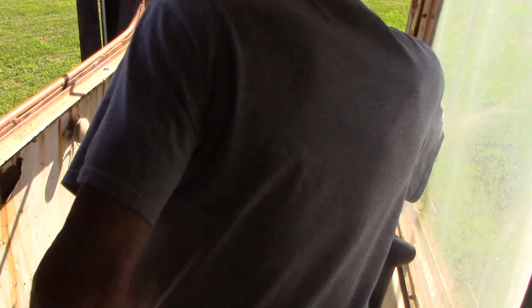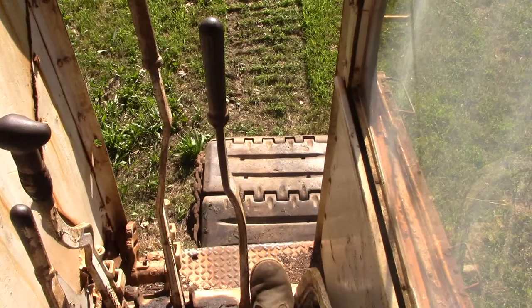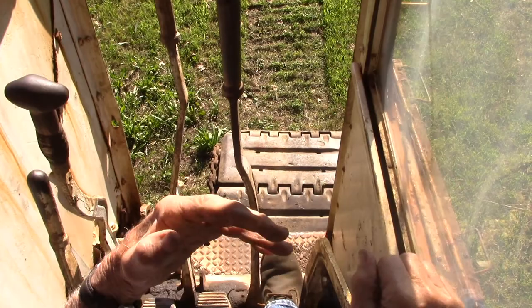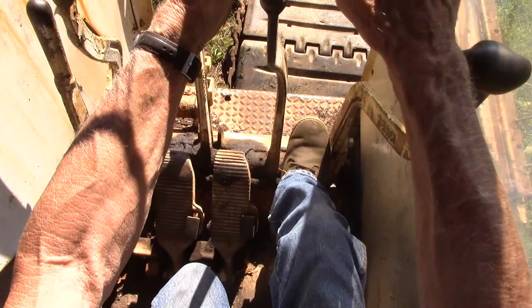Here's your swing lever right here. Push it forward and it'll swing that way; bring it back to swing the other way. When you swing, you're going to use your left hand clutch to stop it swinging. One against the other — that's how this works. When you let your hands off it, it just doesn't stop; it'll keep on swinging. You have to swing the opposite way.